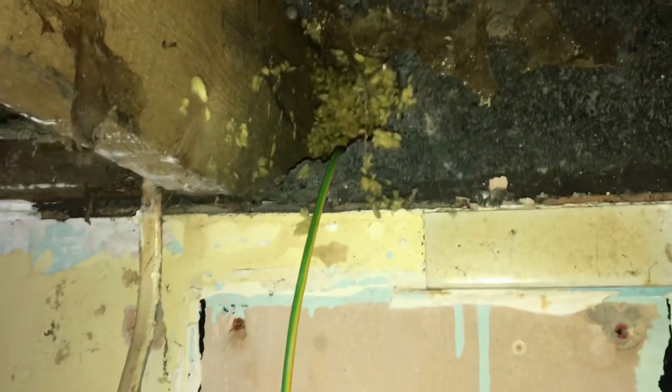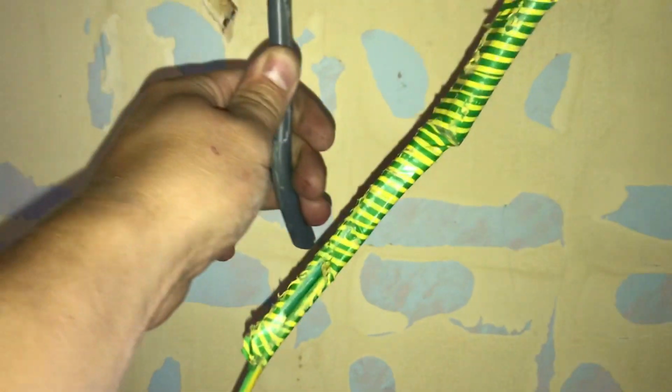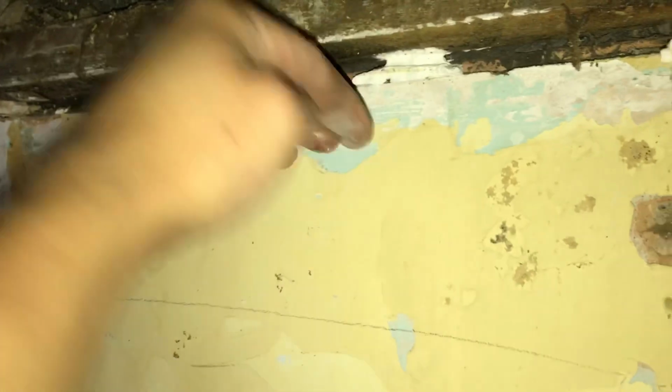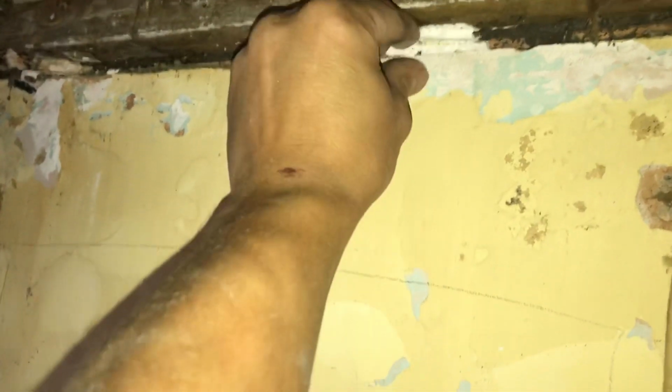See you in a minute. So they're a 3-metre tail kit, and as you can see, that's what we've got left. Comes quite the way down this wall, so literally going to go through that timber cross and then drop in the one entry into the top of the board. It's going to be straight up to this plasterboard. What's this? Yeah, we'll get him a new one of them. There you go, disconnected. I'm going to leave a little tiny gap so he can slide some plasterboard when he redoes this ceiling. So the board's going to be mounted roughly along this old plasterboard line here.